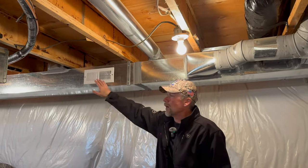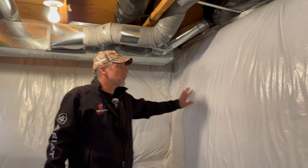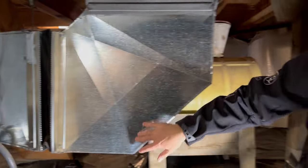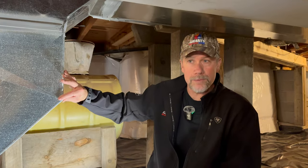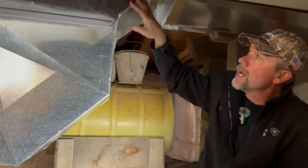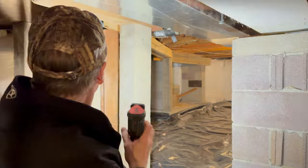We do add a little heat to the crawl space — there's a vent on each side that the customer can open and close. We recommended they insulate the perimeter of the crawl space, which they did nicely. These are custom fittings with flex connections so any equipment movement doesn't transmit vibration through the ductwork. You can see what we call the 'pair of pants' fitting — it angles out and contains turning vanes, like little airplane blades, that allow air to turn smoothly, lowering resistance and increasing airflow and efficiency. Every run has flex at the last three feet.